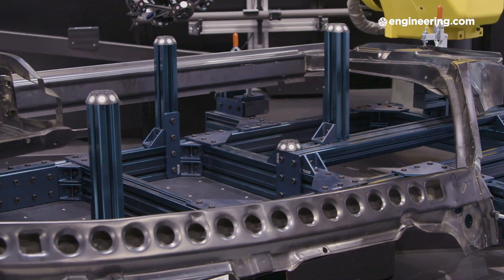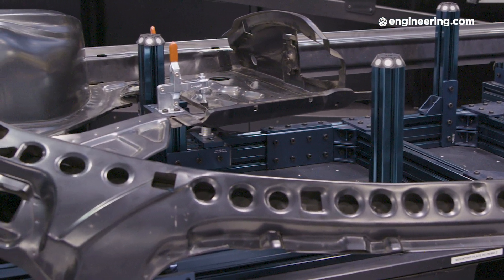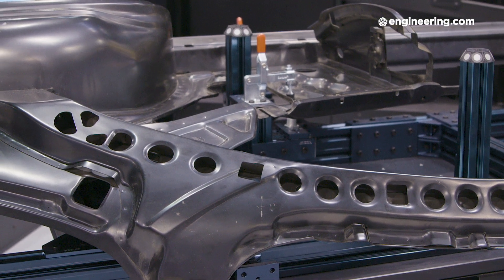In this case we're looking at a large auto part — a side panel. There's a lot of data that will come out of a part of this size. How fast can you scan it? This part, covering all features and datums that we need to acquire, takes about 250 seconds. We're taking about 500,000 measurements per second as we have 14 laser lines crossing to create quite a wide field of view. We can then push into an inspection software like Polyworks or Metrologic to provide the inspection report that you or your end user customer as a tier one would need.